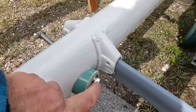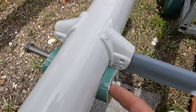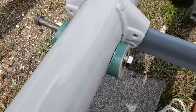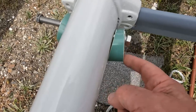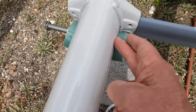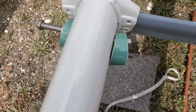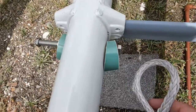The second concern was that the bolt doesn't fit flush to the end and that definitely needs to be addressed — I'll show you in a minute what I hope will allow me to address that. Another concern was that compared to the tangs which were bolted close to the mast, I'm moving the pull further out from the mast, causing greater leverage to bend the bolt.